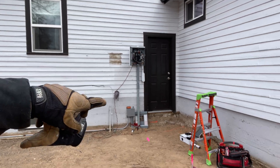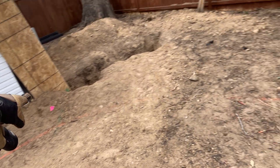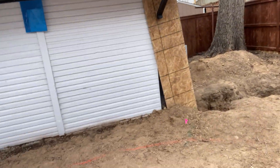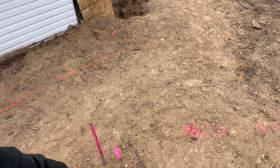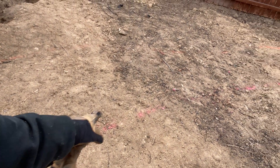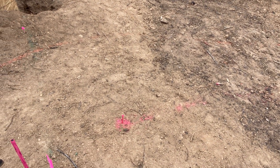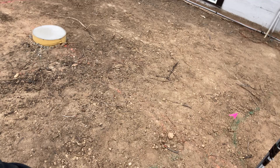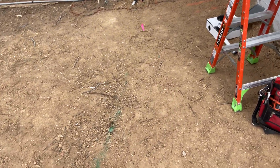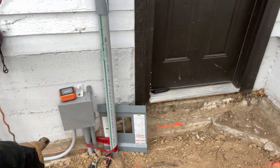The rule is you can't have any power underneath a sunroom, pergola, or overhang — especially of this nature at 200 square feet — and all of this is going to be cement. The way we're doing the cement, that's the fire pit mark. I still had to be about 38 inches deep to keep my distance away, coming in at two feet underground. Tomorrow he's going to dig it, and all the rest of it ended up being 30 inches deep. This came in and out to later come up a pylon and get my switch leg back over to this box.